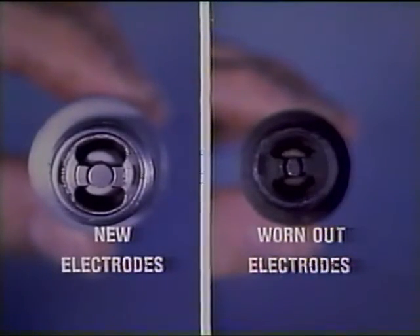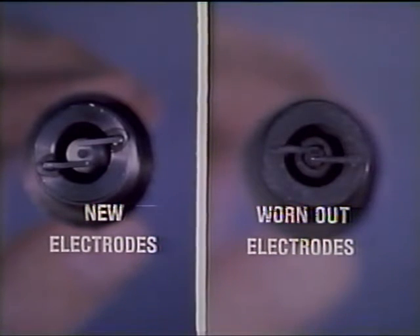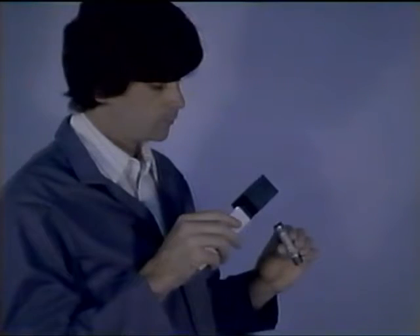Before spending time cleaning spark plugs that may have to be replaced, examine the electrodes carefully for excessive wear. If the ground electrodes are eroded away to one-half of the thickness of a new one, or if the central electrode is flattened by as much as fifteen thousandths of an inch on each side, the plug should be replaced. Fine wire spark plugs should also be replaced if the electrodes are worn away to one-half of their new dimension. Examine the inside of the terminal cavity with a flashlight-type magnifying glass — even the slightest crack in the insulator is reason for rejecting the spark plug.